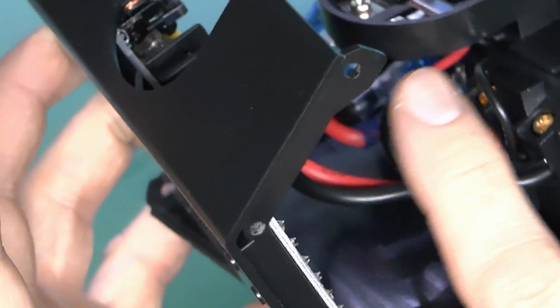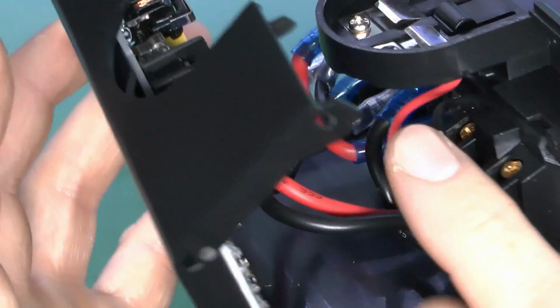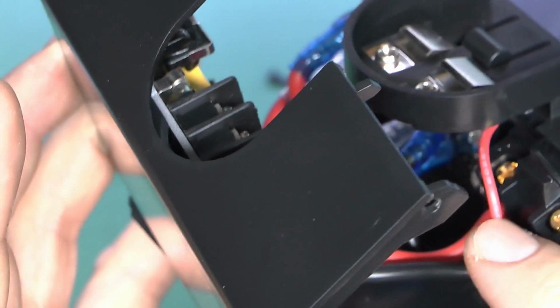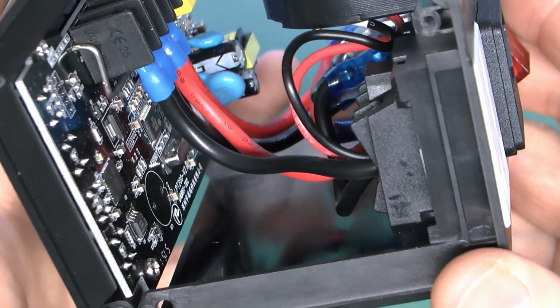So the two here which come over to the lamp socket are somewhat thinner, but bearing in mind you're going to be putting a very small load in there anyhow, and of course you've only got that 10 amp fuse in the back anyway, so not desperately going to be a problem. I mean, that's going to be sort of 1mm size or something like that, so not a problem.